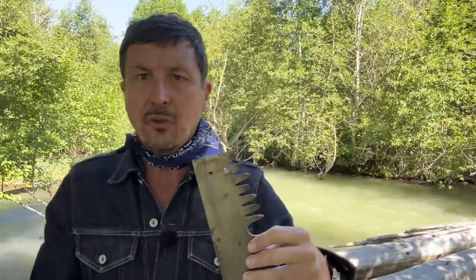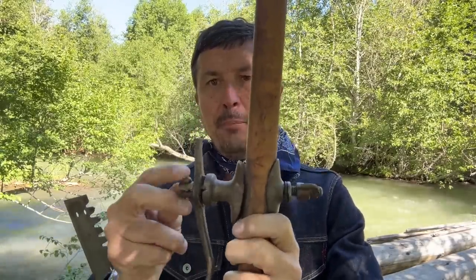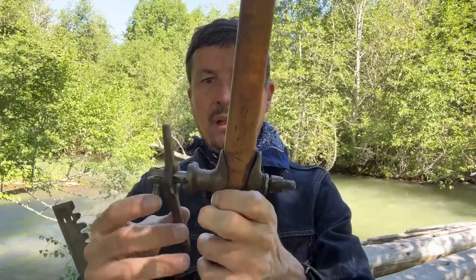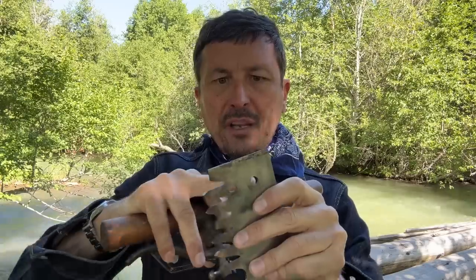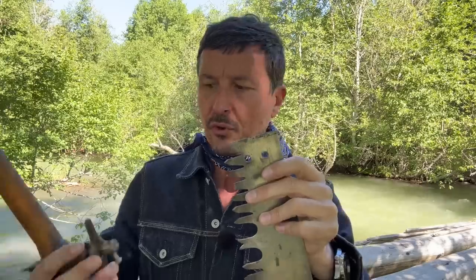The handles are interesting — these are also very rare, so if you ever come across one please do save it. This one is very special: this is an Atkins 24 original. You can see the stamp right there. It's made up of a retained pin, a hand guard, and the nut. You would carry this to the stand and then install it here — there's a low setting and a high setting depending on how you wanted to trim the saw and how much pressure you wanted to exert on the teeth.